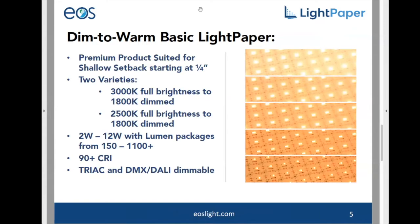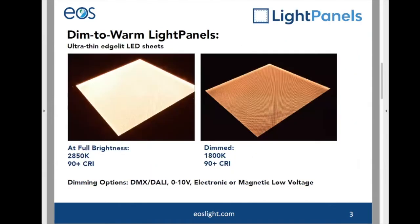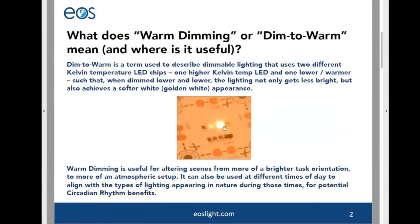Keep in mind, I already went through the wattages with you and the lumen packages from 2 watts to 12 watts with lumen packages from 150 to 1100 plus. And those are in terms of lumens, yes. 90 plus CRI, and then Triac and dimmable with DMX, Dali. So what's actually fascinating about this that I love, it never shuts off. So as one goes down, the other one goes up, and vice versa in terms of the kelvins and the chips. So this area here, great.